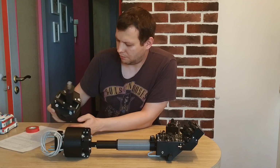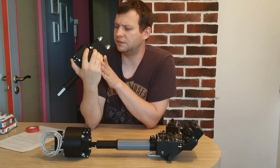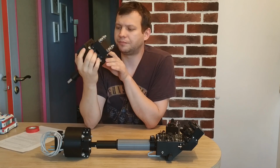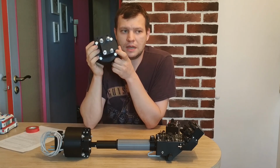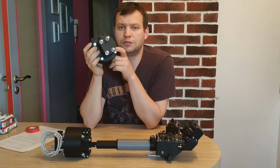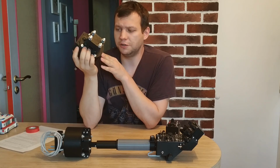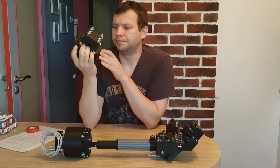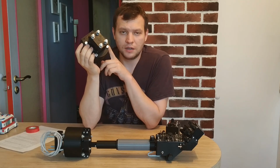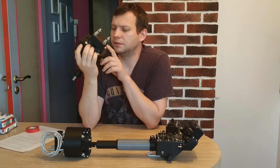I think one more really important feature is that all devices of the Mark IV line can be flashed through these Ethernet sockets. So no more disassembling stuff to flash new firmware. You just plug a special USB UART port to Ethernet cable, which you can of course make yourself. The pinout is on my site. You can look at the new Mark IV collective tutorial, and it's described there how to make one.